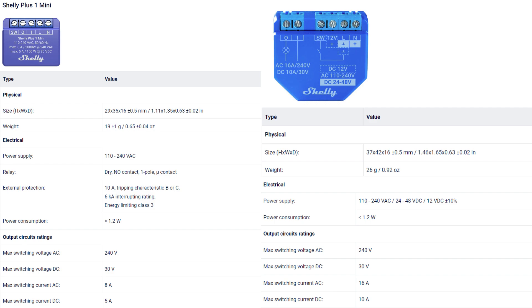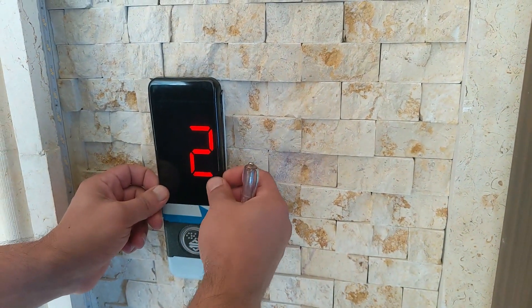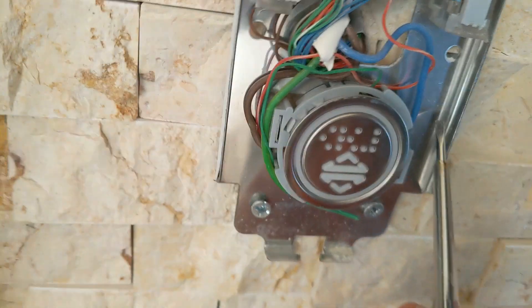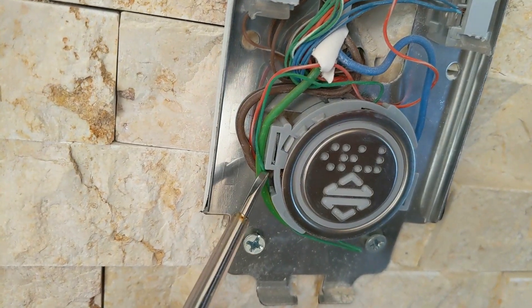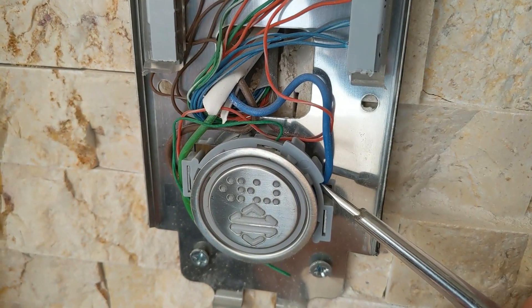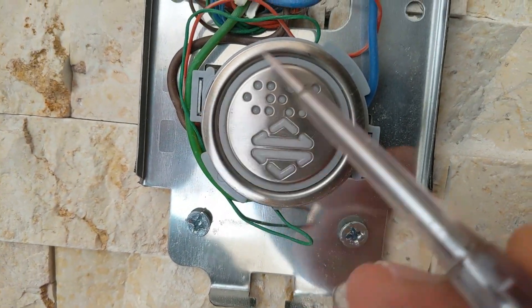Purchase links will be available in the first comment below or in the description box. We will remove the cover of the elevator button. What is important to us are the connected wires. The elevator button has 4 points on it. The first point with the brown wire is clearly the positive line — we will confirm this with a voltmeter. The blue wire is the negative line, and the green wire is a jumper that connects between two points.